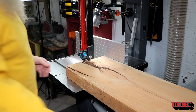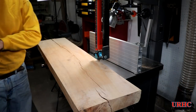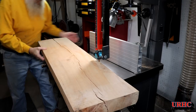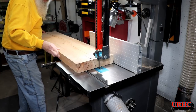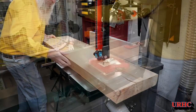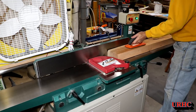I'm starting by trying to break these slabs down into pieces sized so I can get them on the jointer and start flattening and straightening them. I find the bandsaw is easiest for that — just cutting around the pith and trying to take that out of there.